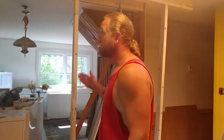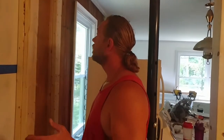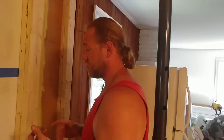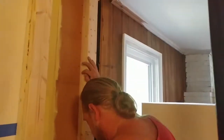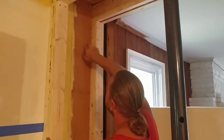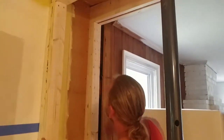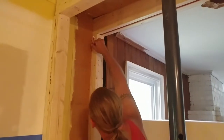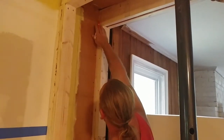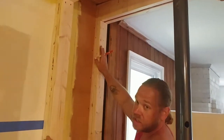But basically, that's where we're at right now. We're going to put in one more stud and then start demoing and take that beam out. One of the things that is wrong with this picture, aside from this being a way undersized piece of wood — you probably could have gotten away with two 2x10s. The engineer calls for all the specs we're putting in. Right here we've got two jack studs. If something goes up under a header, that's a jack stud. A king stud goes from the bottom plate to the top plate. This right here should be a king stud — imagine this board going all the way up, then you bring your beam in and put a jack stud. So this has to go, and we're going to get working on that.